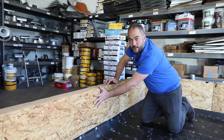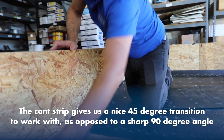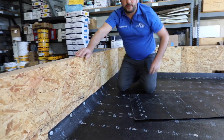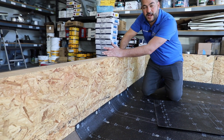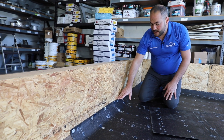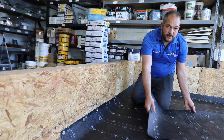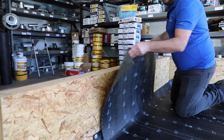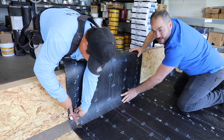In this mock roof, we have a parapet wall build-out on this side. You can see we already have our cant strip installed. The cant strip allows us to break this corner and have a more rounded, smoother transition. When installing your base layer on your roof, you want to make sure you come up and past the cant strip at least an inch or two. You don't have to go all the way up the parapet wall, as that makes it a lot harder. The way we like to do it — and the way the manufacturer recommends — is to come up the parapet wall past the cant strip, cut it, and terminate your rolls there. Then come in with a new piece, depending on the height of your parapet wall, and install the base layer. When you install the base layer on your parapet wall, make sure you come past that cant strip so this corner has a double layer.